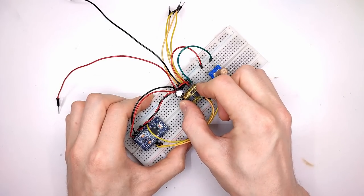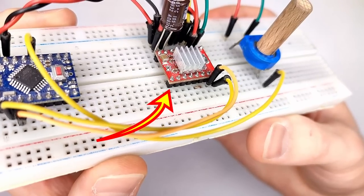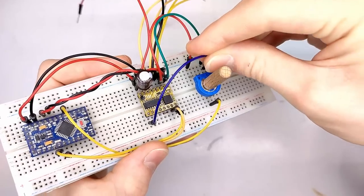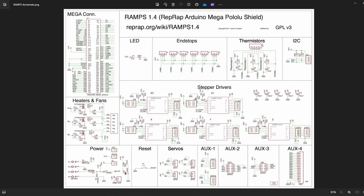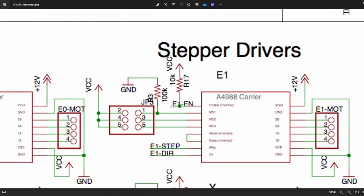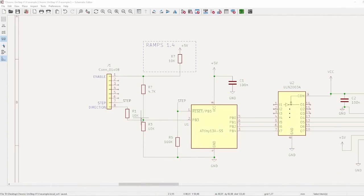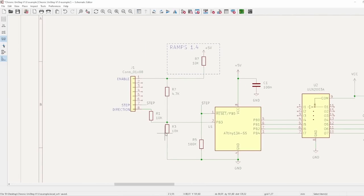However, that wasn't good enough, because the enable pin isn't always in a known binary state. If I plug my driver into a breadboard for testing and leave the enable pin floating, it basically incapacitates my voltage divider by removing one of the resistors out of the equation, resulting in erroneous measurements. And if the driver is plugged into a RAMPS shield, the enable pin by default gets pulled high via a 10K resistor, totally altering the measured analog values.